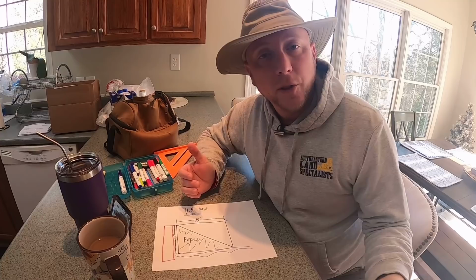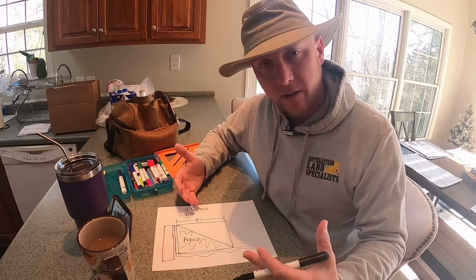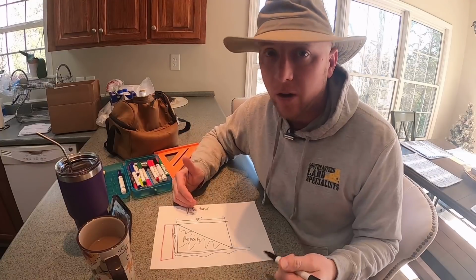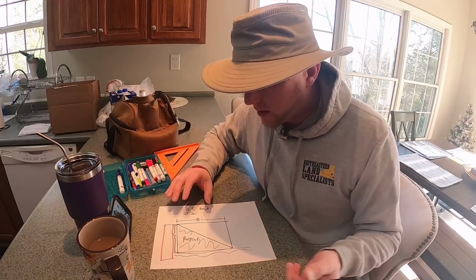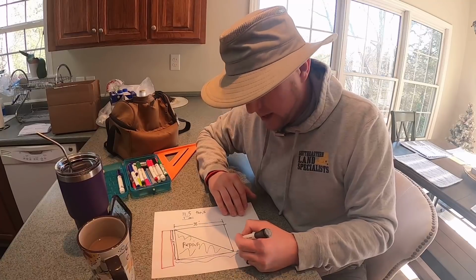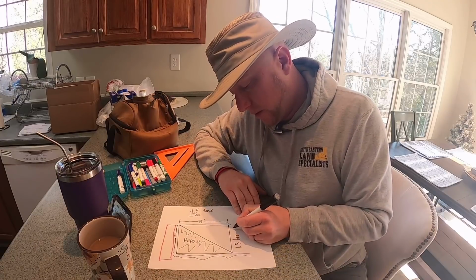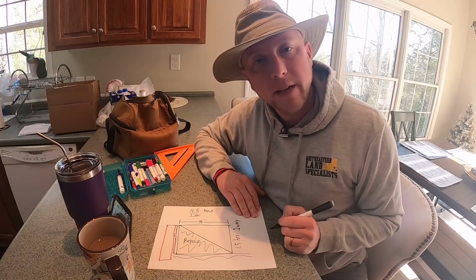Now I'm just going to go through time and travel, all of that stuff, equipment expenses, and I'm just going to make a list. Okay, our travel time to that job by car is 1 hour. Hauling an excavator that weighs 20,000 pounds, that's going to be a bit slower. I'm going to estimate an hour and a half, 1.5 hours one way. Easy peasy for that one.